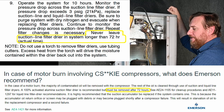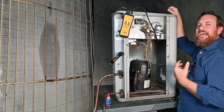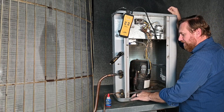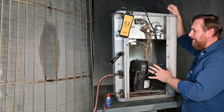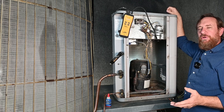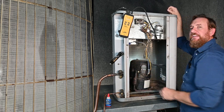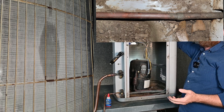There are some important keys to look for. Once we've checked those basic locations, let's start looking at what else is easy. I look for any kind of an oil leak. If we see an oil stain on the fins or an oil stain down low, to me that's a red flag — there's oil coming out. Typically on the high side, you have a high side leak, and more times than not you're going to see oil coming out with that refrigerant. So when I see an oil stain on the system, that's an immediate red flag — whether it's on the fins of the condensing coil or down here at the bottom like this one has.